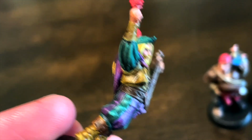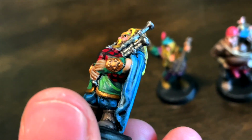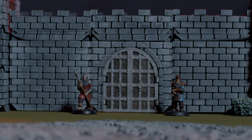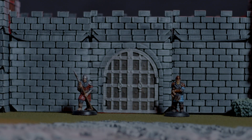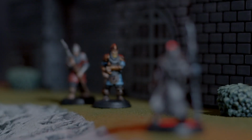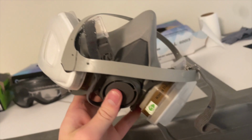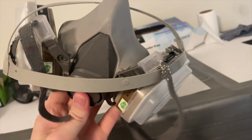More modern printers are going to be capable of a lot more, and there are some other things FDM has over resin as well. Resin has some pretty big safety concerns. Resin is toxic, so you're going to need a plan to deal with that going in. At the very least, you'll need a bunch of nitrile gloves, a respirator, and some kind of ventilation system. And you're still going to make mistakes.